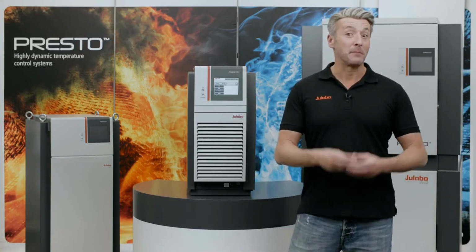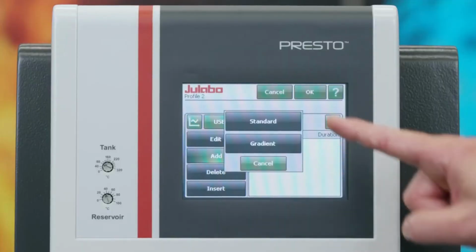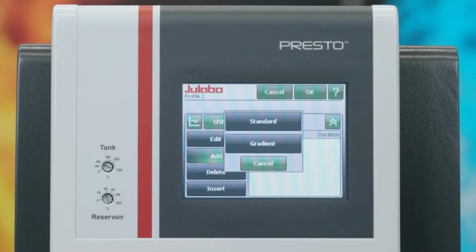Each profile can contain up to 60 individual steps. Simply choose Add. You can choose between two possibilities. Standard mode defines a certain period of time in which the desired temperature is reached. Gradient defines how quickly the desired temperature should be adjusted by degree per minute. Our tip? If you want to reach a certain temperature as quickly as possible, simply choose 0 as the time